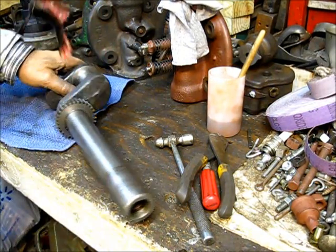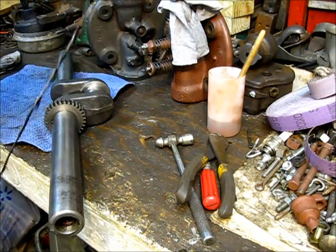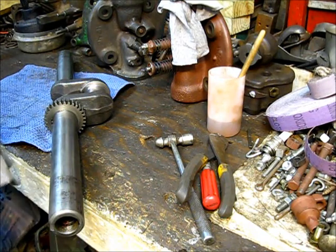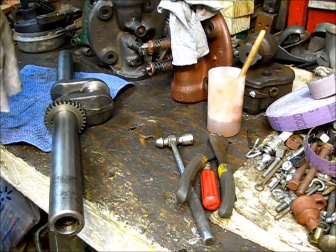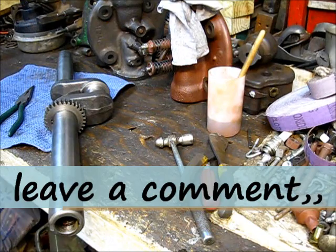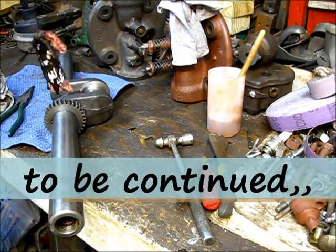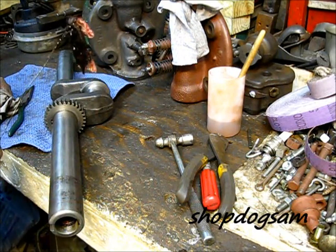Wow, that's nothing like some of them are. But I'll just repeat this whole process there. Put that back through there again. Put on a new cloth there with some lacquer thinner on it, and we'll do that until the cloth comes out clean. Yes. See, to start that engine up and push that grease onto that bearing, it would be a death penalty to the engine. And actually, that one right there is not the worst that you will encounter. But you know, put some new grease in there.